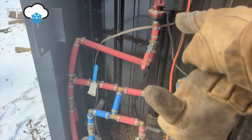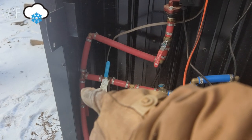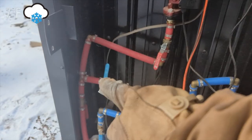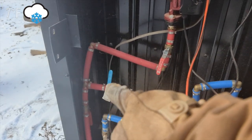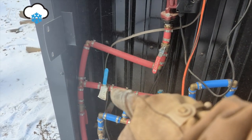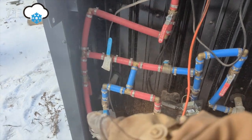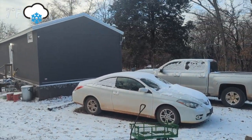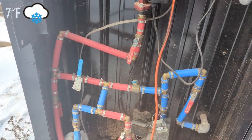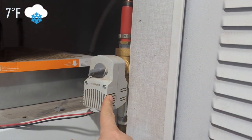This may look like a plumber's nightmare but it makes sense if you know what you're looking at. The water is coming down this pipe right here. There's a T-junction here but this valve is closed. In normal operation, these two valves are closed so no water flows between them. The water goes down to the big house, hitting both the hot water heat exchanger and an air heat exchanger.